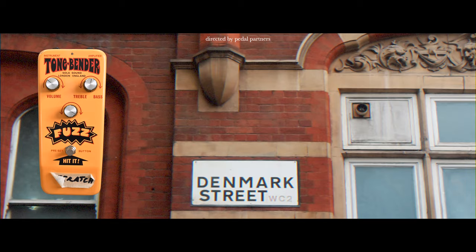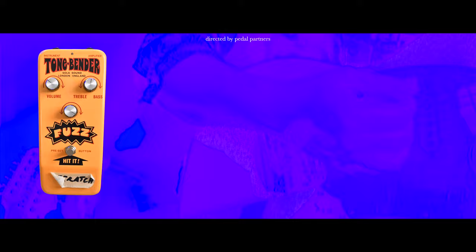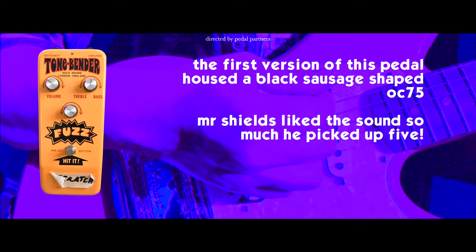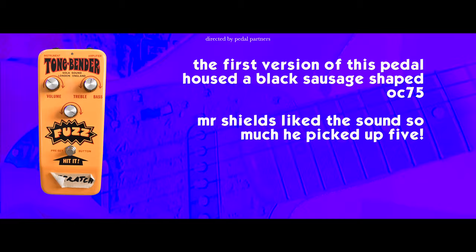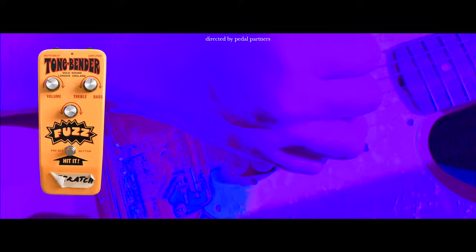They originally had a shop down Denmark Street in London as part of the big movement there in the 60s. Jake says the circuit for the Yellow is interesting, involving a bit of serendipity. It's basically an overdriven single Germanium transistor common emitter stage. When developing it, he accidentally used a flat battery measuring 4.7 volts and it sounded much better — it biased itself off if driven too hard, breaking up the sound. That's something he's always really liked for fuzz pedals, and it's what they do with the Violet Oscillation as well — that kind of breaking up sound, great for riffs and chords.